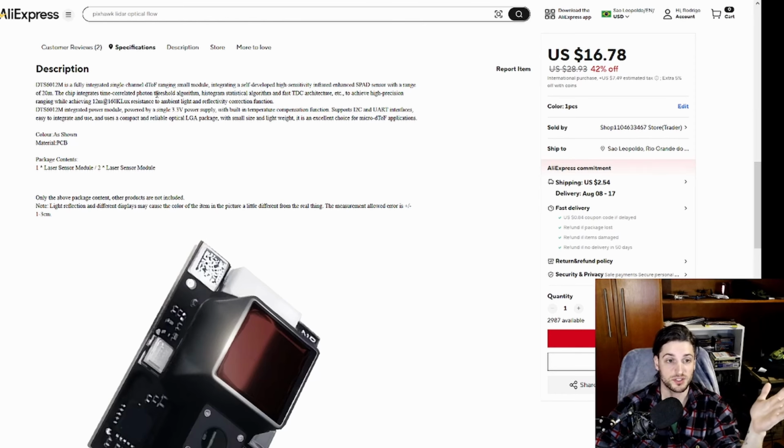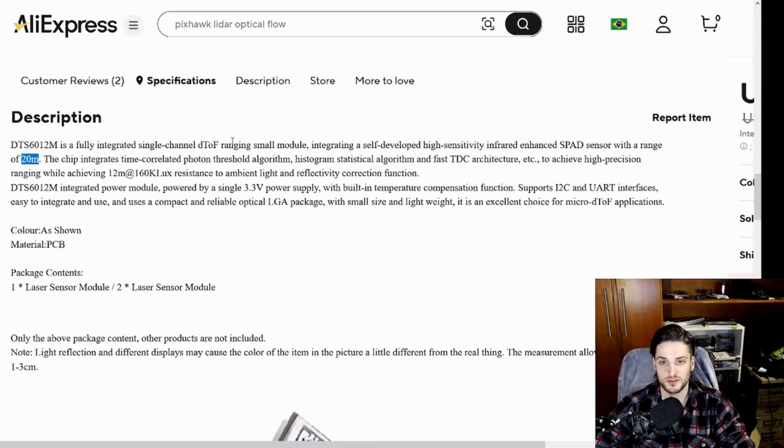But the important parts for you that is starting to use LiDARs right now is you need the ideal distance. So the maximum distance you can get a measurement with 100% reflectability. And then you usually need to know, if the reflectivity is lower, how far can I sense stuff? So here it says 20 meters ideal distance. But with sunlight on, this is a really high number, by the way, and low reflectivity, you have 12 meters. So you lose almost half of the distance.